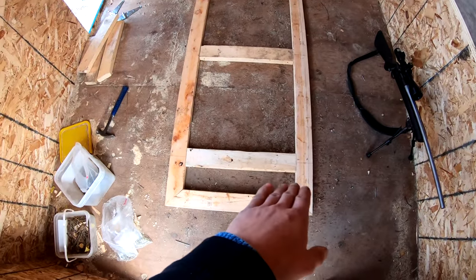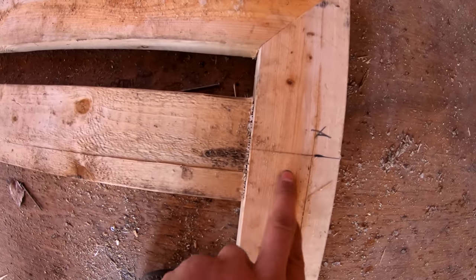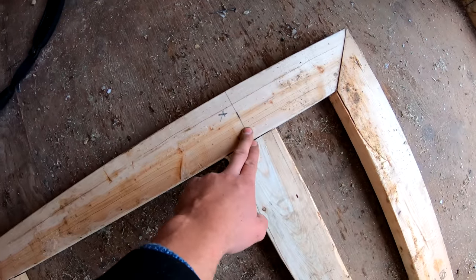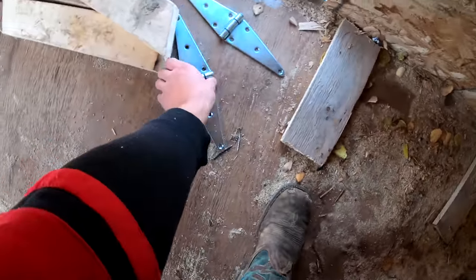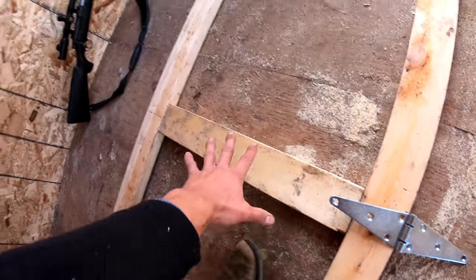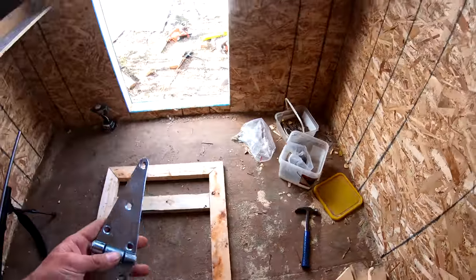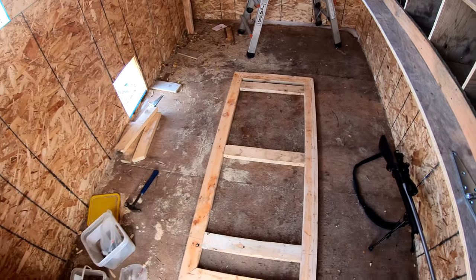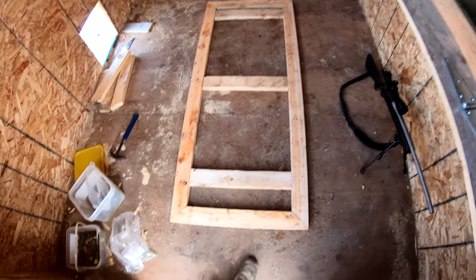Here's where we're at now. I've added boards across — they were cut 22 and 3-quarters inches and I've lined them up directly in the center. This one is 5 inches from the top directly in the center, this one is 10 inches from the bottom directly on center, and this one is directly in between those two. That's where I'm going to put my hinges, and it'll add extra support for the door having these boards across the frame. Now we're going to cut a sheet of plywood to the dimensions of this door, nail it all the way around — really nail it good — and nail all these boards across too. Then we'll insulate it and put another sheet on and hang it up.